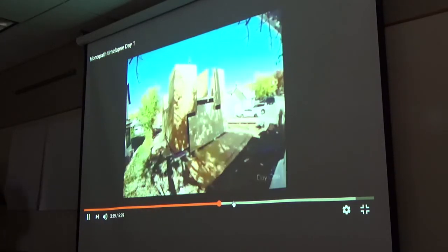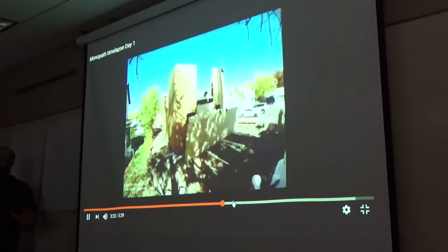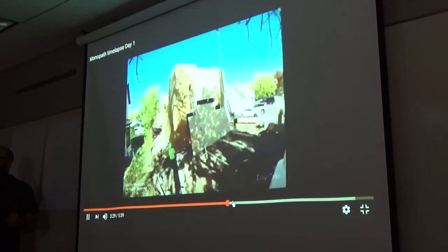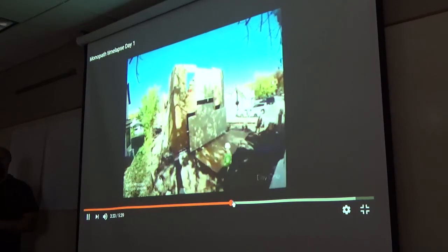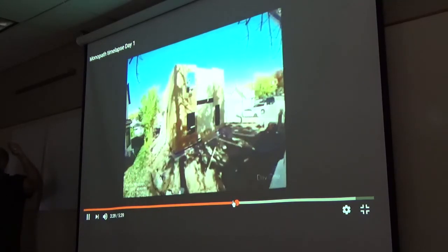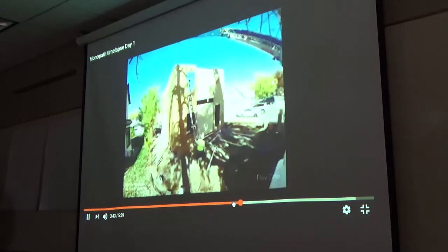When you have 10 people on the site, you can also start assigning somebody, okay, we've moved past this phase, now the 2 of you go and start cutting out window openings. And so you start to see window openings pop up on this. From a security standpoint, in whatever neighborhood you're in, we'll take those cutouts and tilt them 30 degrees and tack them back to the wall so you don't have a wide open building.